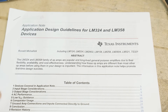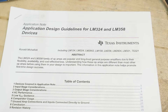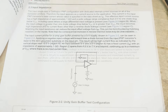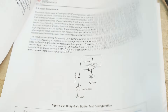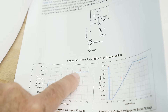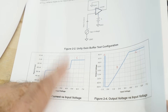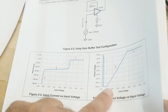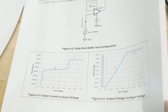That's probably why I threw them out of my memory. But if you learn how to use them, they do stuff - and do some things quite well - but you really have to know how to use them correctly. The first thing that's different is the way they draw current on the input - there's no linear response to input current versus input voltage, there's a step in them. Also, output voltage versus input voltage, they can do a phase reversal on you - but only if you go below the negative rail.